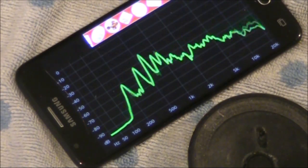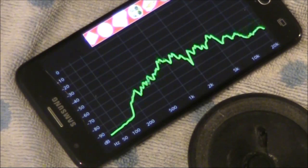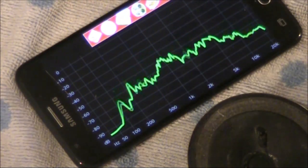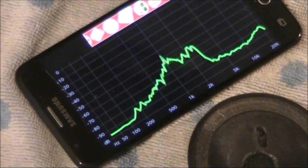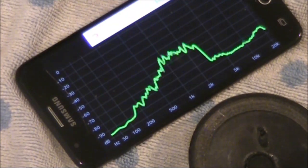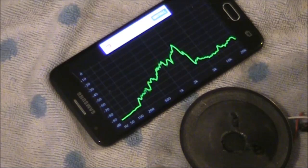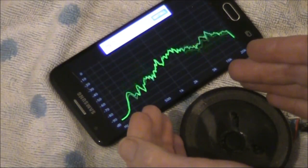Next thing, I'll try to find a weak CW signal. It's around the middle of the day, but there's a beacon on 3699, 80 metres. That's in Sydney, about 700 or 800 kilometres distant, and we'll see if we can receive that. This is the beacon. Now we'll see if this handmade audio filter improves reception clarity.